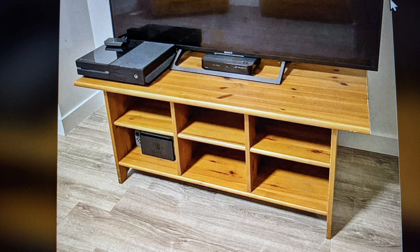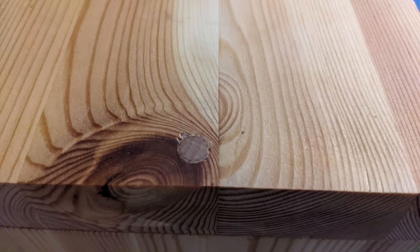A couple of things I didn't mention during my videos that I just want to mention now: first off, where I did my screw holes on the top, they had a funky system holding the top down and I didn't like that because I'm using it more as a support. I wanted it sturdier, so I actually drilled down and screwed down from the top into the sides. But I wanted to hide the screws. Because I shortened the depth so much, I had dowels left over. So what I did was drill the top of the screw head to the right size for a dowel, put it in, hacksawed it clean, and then sanded and stained over top.